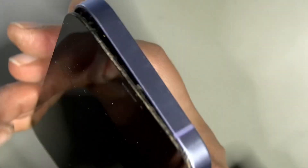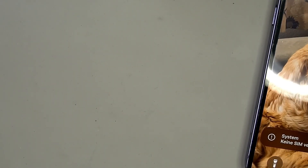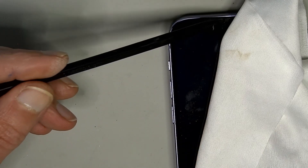Good, let's turn it on and test it. I'm calling. I can already hear the stereo — here's the top speaker and there's the bottom. Top speaker — that should work. Hello? Yeah? Awesome, I can hear you. Test, one, two, three, test. Good. Our thought was right: we didn't have stereo before, now we have stereo sound and we can hear audio from the top grill.